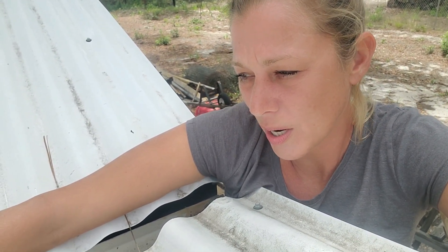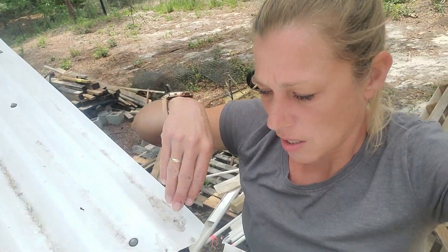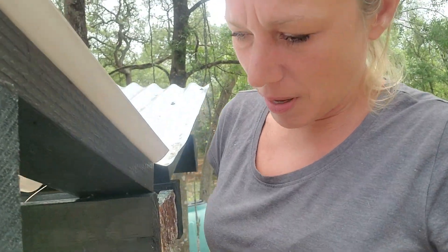I'm gonna pull that screen out of there and then show you what I plan to do. I have to be able to catch the debris because if debris gets into the bottom of the barrel and tries to go through that PVC to feed the chickens water, that's gonna get clogged and then we have a whole other mess — trying to get all that unclogged from all that PVC is not a good idea. So I'm gonna pull the screen down and then show you what I got. It's not a beautiful fix, but it's what I can think of for right now with what I have on hand.